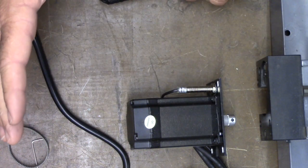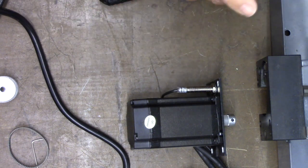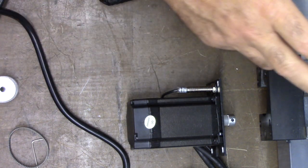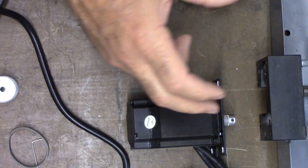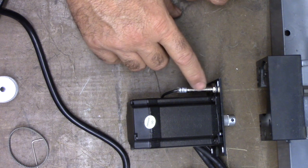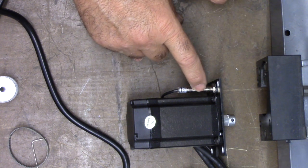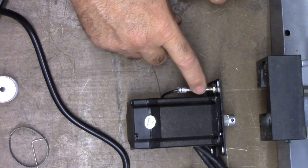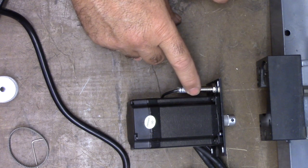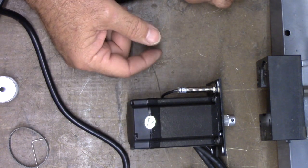You're going to take it to a preset distance on the machine, put marks on it, and you will jog it to those marks, and then you will home it. What will happen is CNC 12 will move the carriage until it sees the magnet pass in front of the X and Z Hall effect sensors, and then it'll call it home. It should be a very reliable way of setting the home position on the machine, which is important to find the center line of the spindle axis.